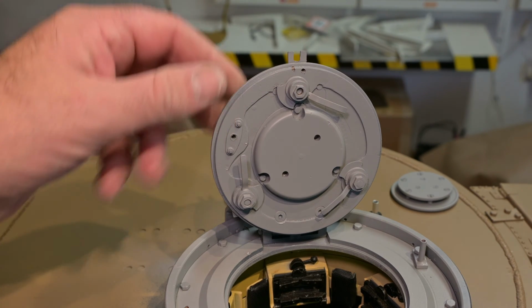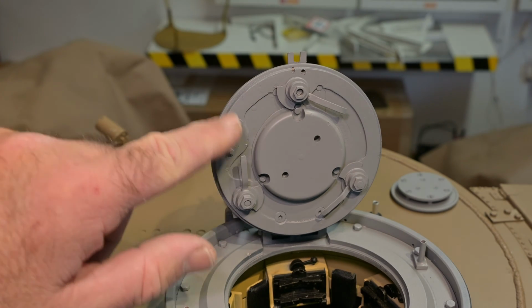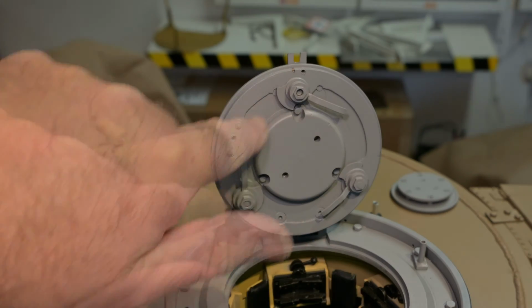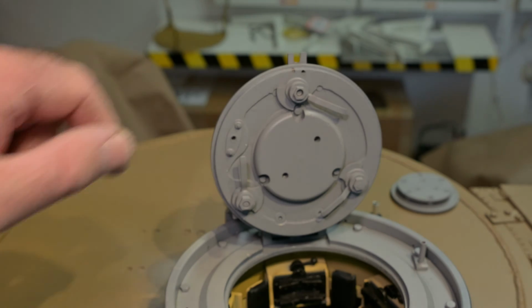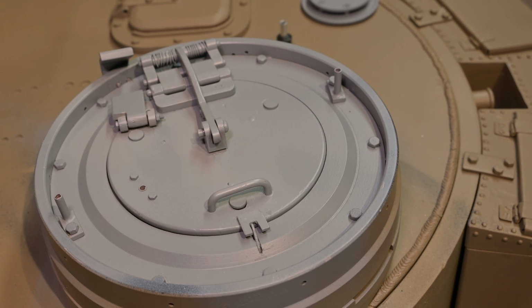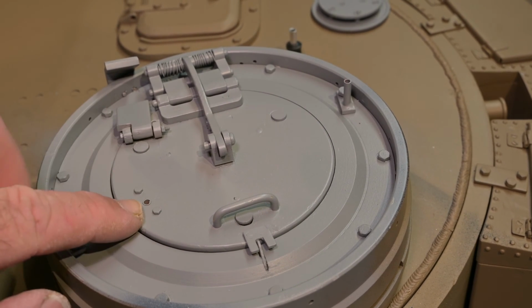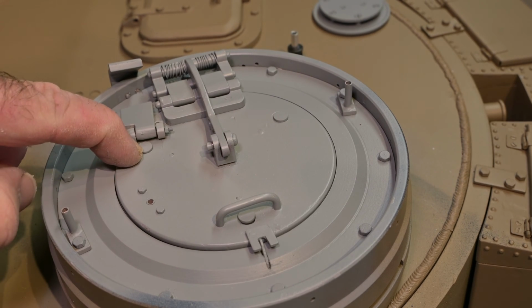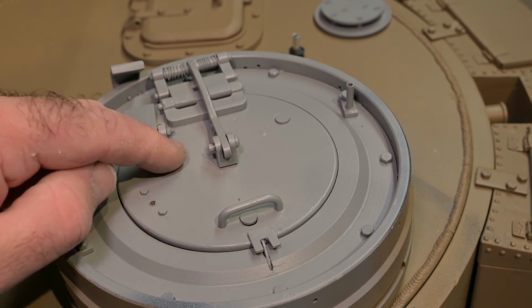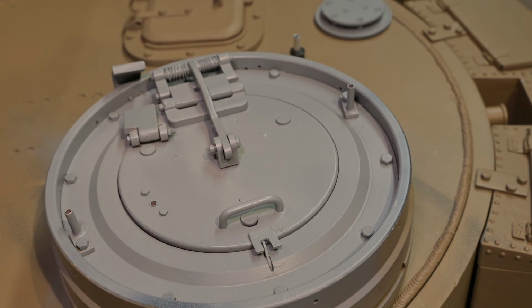The hatch itself is the original Armortek part, which didn't have any texture on the inside, but I've milled out the required shape and fitted the latches. Again, looking at the top of the hatch, these are the fittings where the keyhole is, and these would hold the locking catches on the inside. The 3 screws here would have been welded in place on the original, and they hold the head pad.